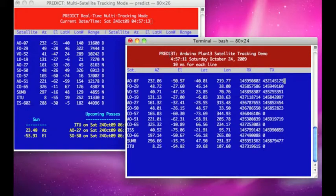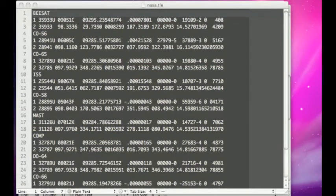Finally, you can read on the third line how many milliseconds it takes for the Arduino to calculate the information for each satellite. It can do it in about 10 milliseconds, so this is enough to process probably 100 satellites in a second. You probably don't want to cut and paste these calculations into every satellite-related program, so they're encapsulated in a library file using the Plan13 algorithm.